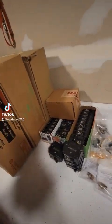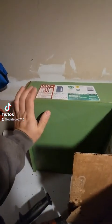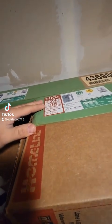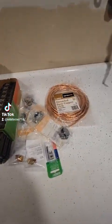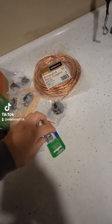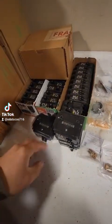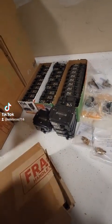What's up gang, so today I got some panels to swap out. I'm swapping out my 200 amp panel and my tenant's panel to 100 amp, just updated with more spaces so they'll match. I got one going in my attic and one in the garage. There go all my breakers, my grounding line, the copper grounding rods, grounding clamps for the rods, water pipe adapters, wire clamps, and a bunch of breakers. This is all existing wiring so I don't have to upgrade to AFCI.